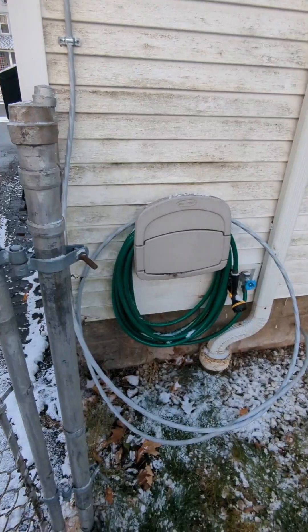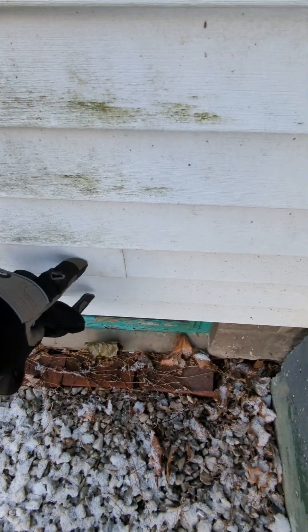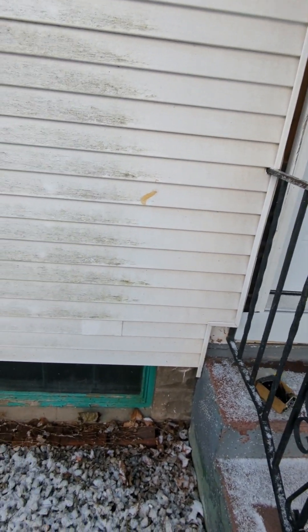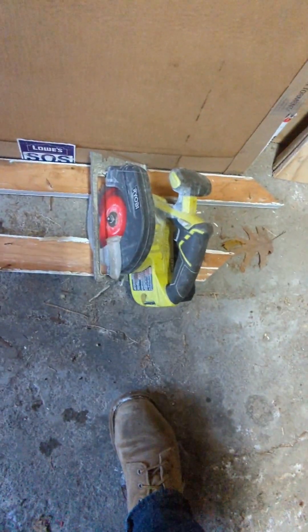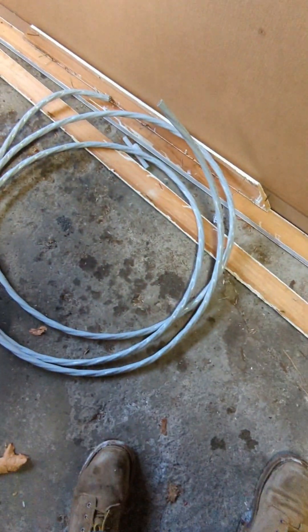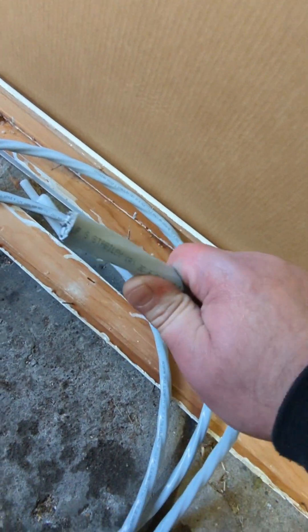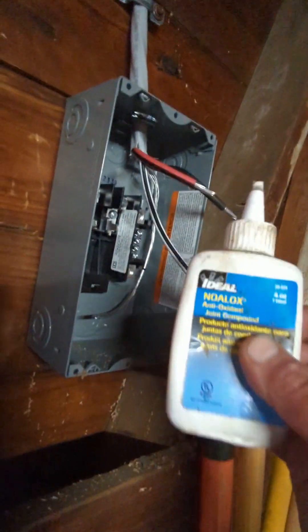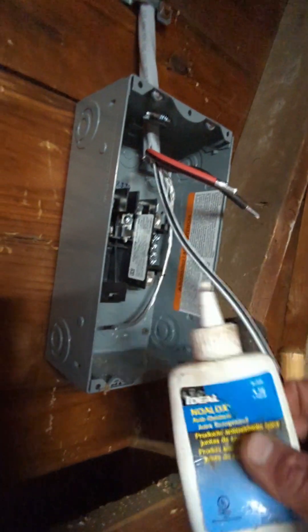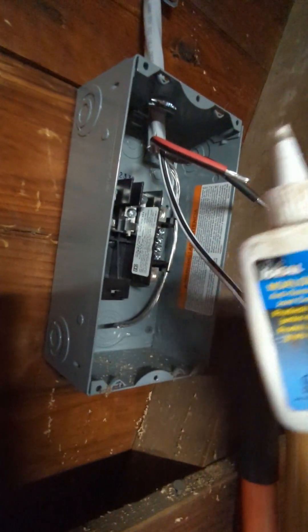I've got my SER ran on the outside of the house to the point of connection to the quadplex. I'm going to enter right down here to the left of the garden hose. Originally I messed up — I was going to enter right here, but I found an old piece of siding and glued it on there. I'm cutting my cable with my circ saw today because I forgot my ratcheting cable cutters. The circ saw works great on bigger cable — the aluminum cuts real clean. Super critical when using aluminum wire: no-lox antioxidant joint compound. This goes on every connection — inside, outside, every splice, everything.